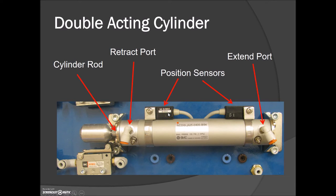Later on, if there's time during the course, we'll make use of these position sensors. They're pretty sure to be reed switches — inside the actual cylinders there's a magnet, and when that magnet moves across the position sensor it closes the switch and sends a signal. We can then see whether the cylinder is in the retracted or extended position and send a signal to the PLC using the two terminals here. The brown wire is always positive and the blue is negative if they are polarity sensitive. The cushioning on either side can be adjusted but they're already set so don't touch them.